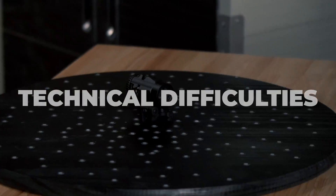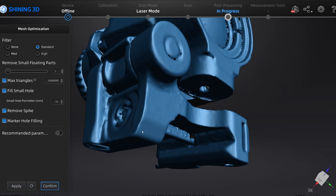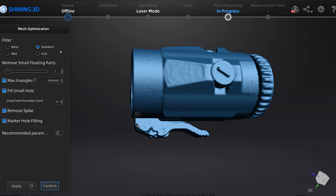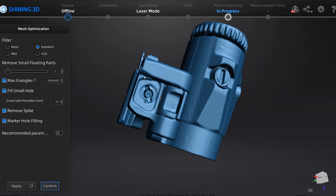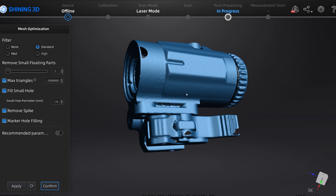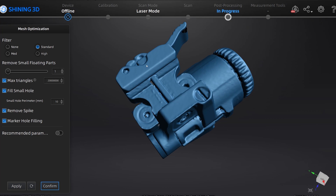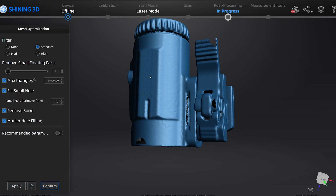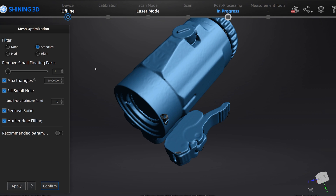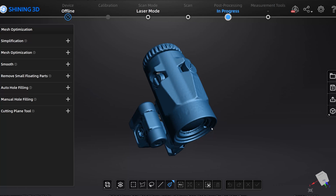We actually had some technical difficulties with the screen recording of this project, but I wanted to show you the final results anyway. We've got a lot of scan data here — basically aligned a bunch of different scans together to get this result. This is done on the standard filter, which generally smooths the model a little bit and removes excess information so that surfaces are easier to grab in your reverse engineering software. If I wanted to extract the cylinder, planes, and different faces as reference points in CAD, I would do that in Geomagic Essentials — the bundled software we sell at visionminer.com. In the software you can just click 'third-party software' and go straight to it. This is the baseline version for working with all scanned data, allowing you to create features that you then export into whatever CAD program you're using.